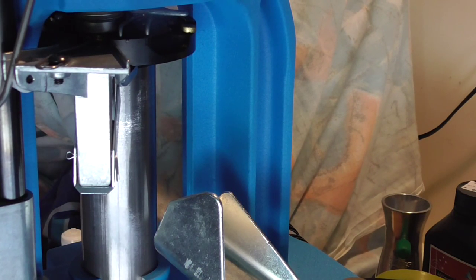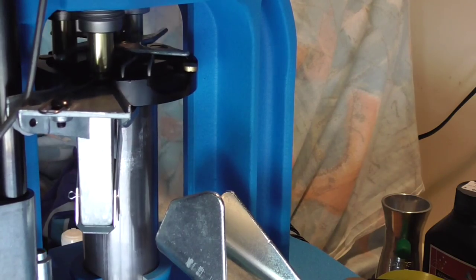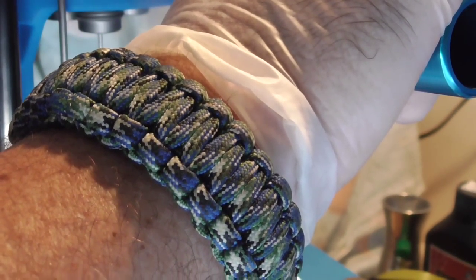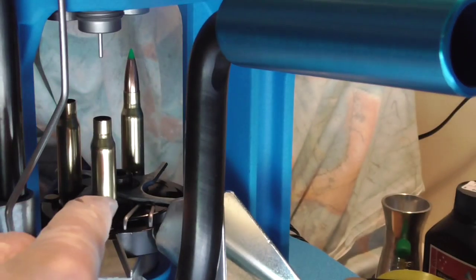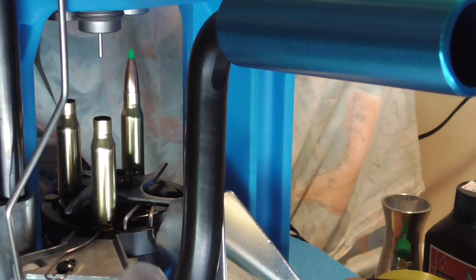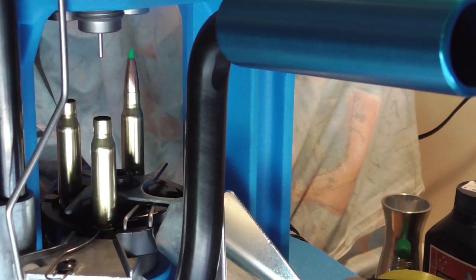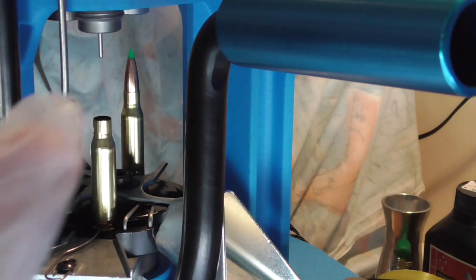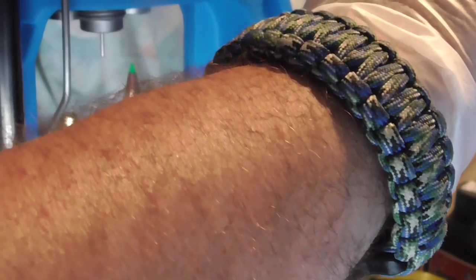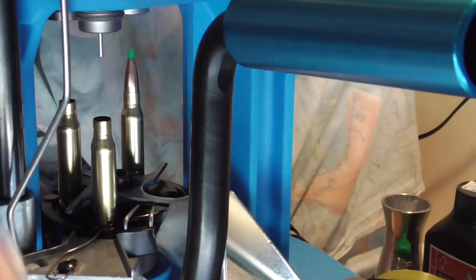Okay, the third one is pushing the bullet into the brass case. All right, so that's fully down. Then we push it back up. And we give it one little more push forward to prime this first case. We want to put a new primer into it, and we want to put some new powder up the top there, some new powder for this next case. All right, so push it forward. You feel the primer go in, and that would be filling up the new lot of powder.